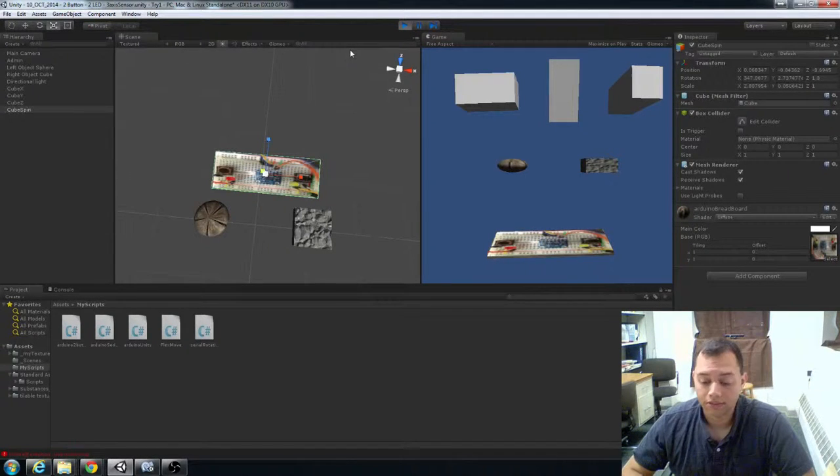Whereas the accelerometer is focused on gravity or acceleration in any direction, which I'll show you in a second too, the compass will orient based on the biggest magnetic pull, which is normally magnetic north, and so then you can orient your controller based on that. So that's another way you could do it, and then you can also use a gyro. Some of the most in-depth sensors for positional data actually incorporate all three, which is the accelerometer, the compass, and the gyro. But that's like $50. If I have to get there by the end of this class, then I will, but I'm going to go ahead and go with another $12 deal right now.